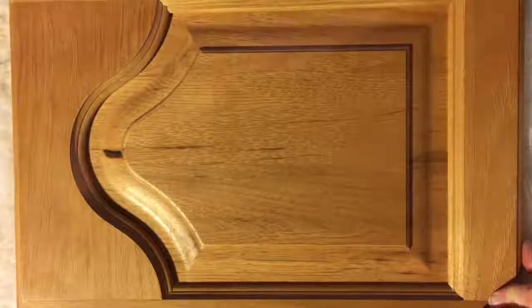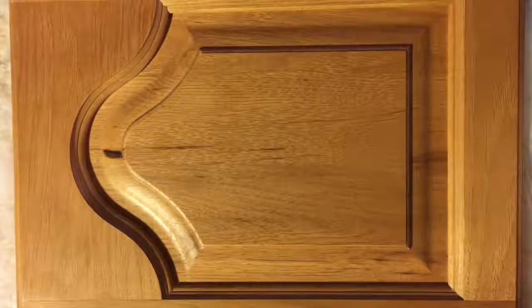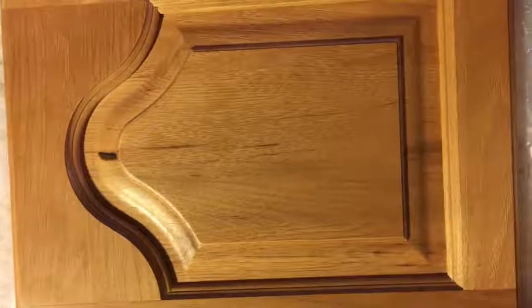These cabinets are going to be white, and you have to be really extra careful with white. You can have your piece all painted and everything looks fine, but then after they're dry you start seeing some yellowish streaks or spots — discoloration throughout the finish. A lot of times the reason that happens is called bleed-through, meaning the wood tannins are bleeding through your paint surface.